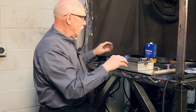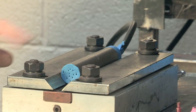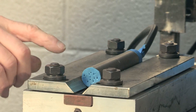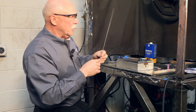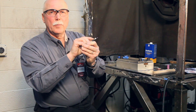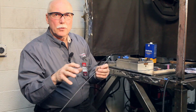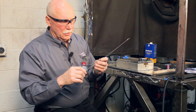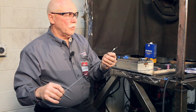So now we're actually ready to weld. We've got shielding gas on the back side, coming through the part. We set it up, purge it with probably a high flow rate — 20 to 30 cubic feet per hour — then turn it back down to about 5 for welding, just so we get a positive pressure in there. Our filler metal is selected from the chart in the GTAW book from Lincoln, which will recommend a filler metal. Filler metals for titanium are generally flagged with exactly the alloy. In aerospace, these flagged alloys are accounted for when you take them out to your welding station and when you bring them back. There's a lot of quality assurance in aerospace. In motorsports we don't have those regulations, but they're not bad to follow. So we make sure we have the right filler metal.